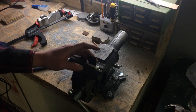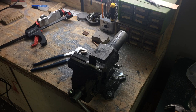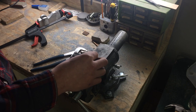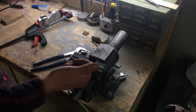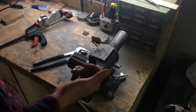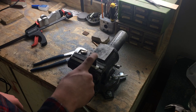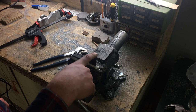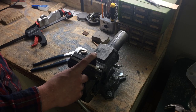Here's the back plate that I'm going to weld up to the back plate slit. I'm going to try heating this up and just bend it over. I'll put some Kaowool in here to protect my vise and so the heat doesn't dissipate through it. Maybe I can get this red hot and just bend it ever so slightly so it fits that back contour of the axe head. Let's see if it works.